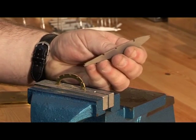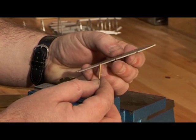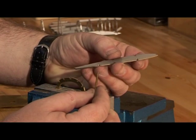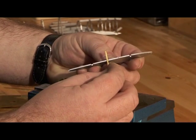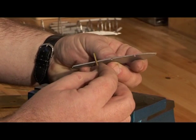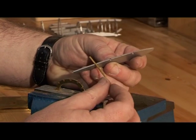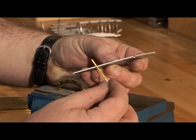One thing to be aware of on the wing components: you'll find that one of the notches on the bottom edge of the part is bigger than all the rest. Don't worry about that — the rest of them should be a nice easy fit. That one looks slack but when it's actually fitted together, the stringer goes at an angle so it's supposed to be that bit bigger.